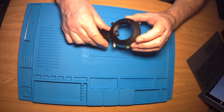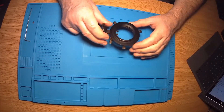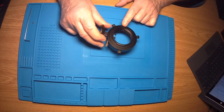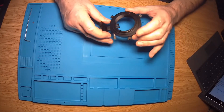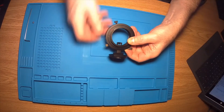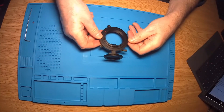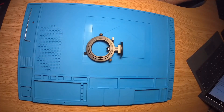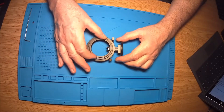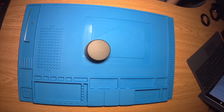So if we were to locate it and configure it this way, then the prism is looking down the telescope. This here is where the pin on the release catch on the EOS camera would be, and therefore this is a sensible place to locate it. So if we just line things up like that, make sure that's nice and central, and then secure these three screws — not too tight. That's then ready to be put on the front of the EOS camera.